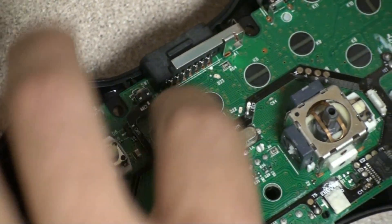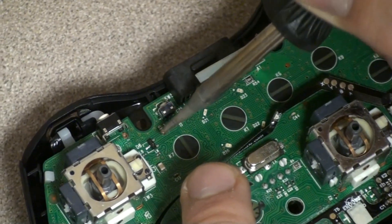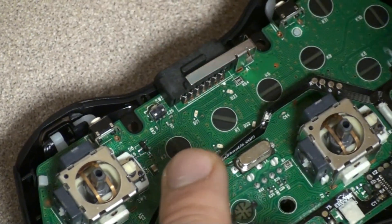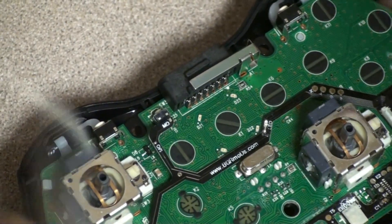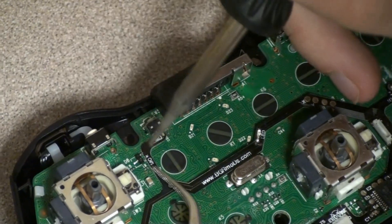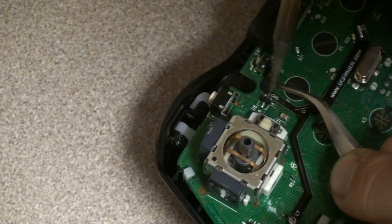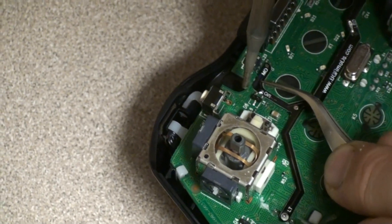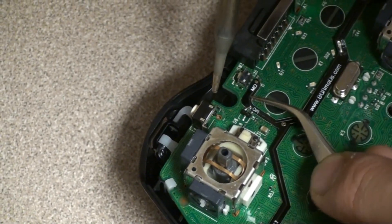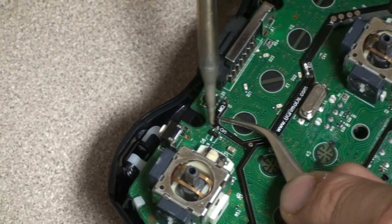Do the same thing I was talking about — have a little bit of solder on your tip, touch this point right here, slowly draw it away, and it creates a little pinnacle. Then you're going to connect the two points right there.